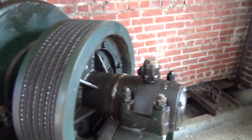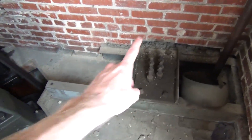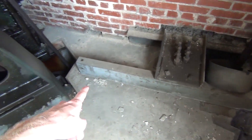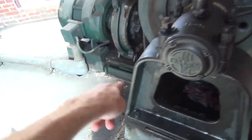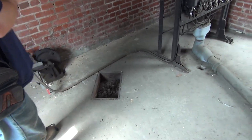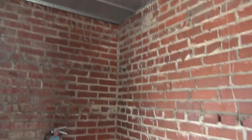We got our cables that go over, and this is a two-to-one system. You can see over here this is where the counterweight would go. These ropes go down through a pulley on the counterweight and then up into the motor, then down again to the actual car where it runs across and connects right there. And finally we have the little governor. Other than that there's not a whole lot here, so let's take a look at it in action.